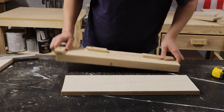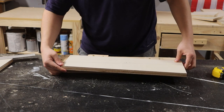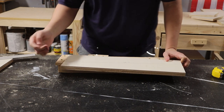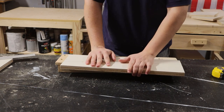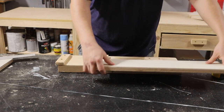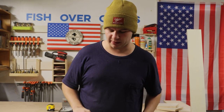And then what you're gonna do is take a scrap piece of 2x6 that you have, and you're just gonna line up this line on the edge here, just kind of eyeballing it. Obviously for mine, it'll slide right in place because I've got these three pieces blocking it. But once you have eyed that, you're just gonna stick this down. You can even put some double-sided tape down, and then just screw in your three blocks there. So then when you run this through the table saw every time, you just put it in the jig just like that and go. So that's a very quick tutorial on how to make this. If you really want another video about this, comment down below, maybe we'll do something like that.